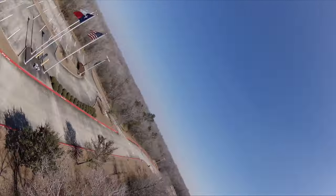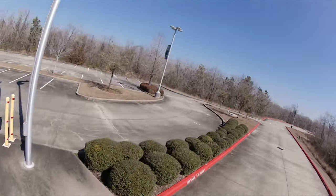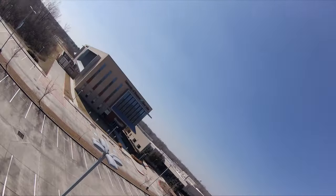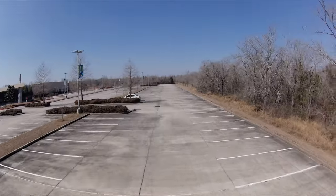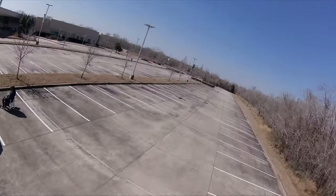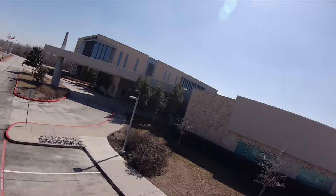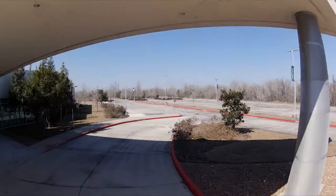So this is actually pretty nice. If I was gonna build a first build, you could build modern day motors and put a throttle cut on there to get the same feel. But if you find some of these older ones... see, when you put a throttle cut, you've got to figure out: do I want to put an actual cut? Do I want to put a throttle scale? Do I do it in Betaflight? Do I do it on the radio? They all do kind of the same thing, but slightly different.